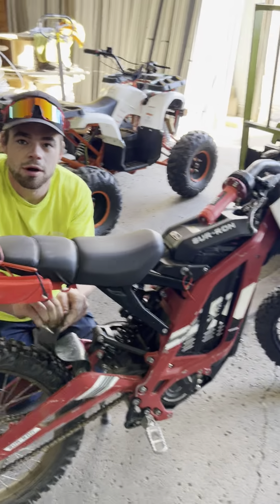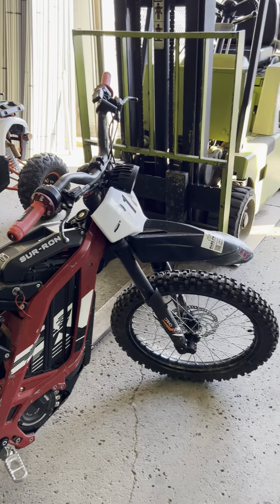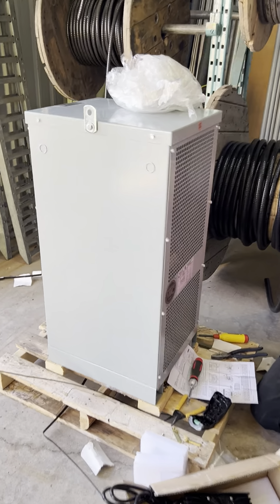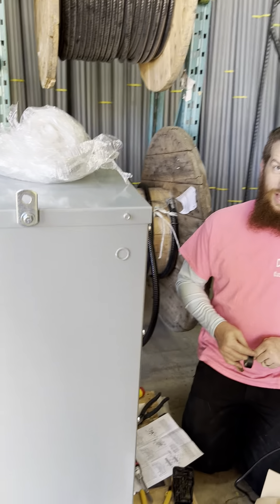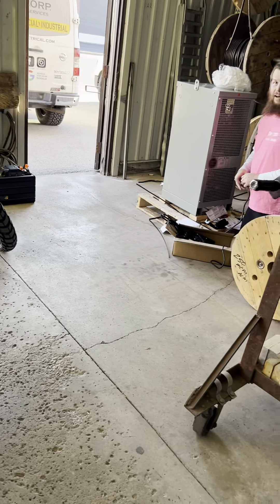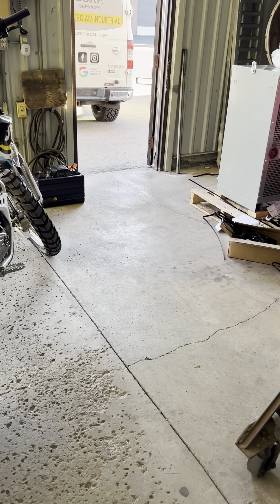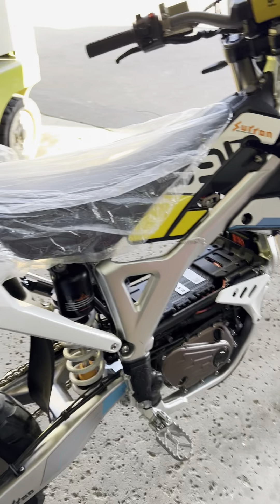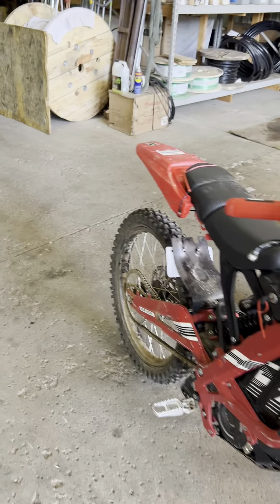More than halfway. How many junction boxes were down there? There were like 12 junction boxes — two are still standing providing temporary power. There were junction boxes everywhere. And there's that one big 8/3 black wire coming from the front corner of the house — we haven't sourced where it's going yet. Not sure if it's the dryer or if it goes out the back or front.